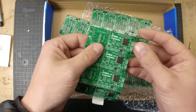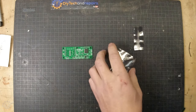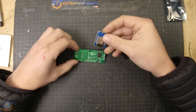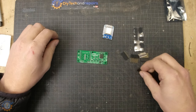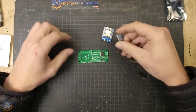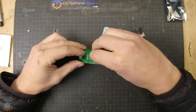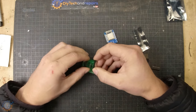Here we have the controller, and here we also have the ESP that I'm going to use — the ESP8266. As I said, you can use the ESP32 as well, but currently the 8266 works just fine and it's easily swapped out later on. You can solder the ESP directly on top by just adding header pins, but I want it to sit so I can exchange it if needed and program it on the outside. So I'm going to add this kind of socket pins here, and on this one we add those as well.